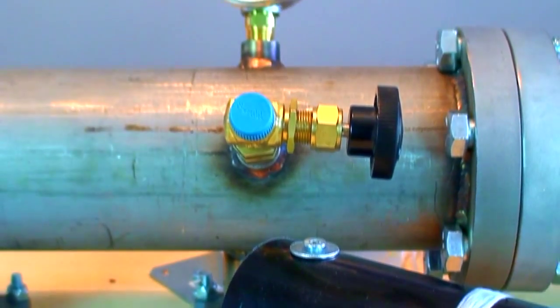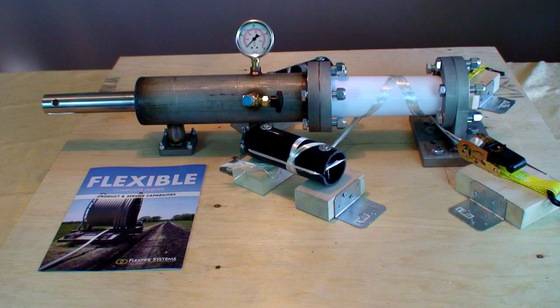We needed to wrap the fibers around the bladder at a specific angle for testing purposes. The tension towers do that. They are placed in certain positions to guarantee a 55-degree wrap angle around the bladder. This has been capstone design project 24, the Pipe Flexor. You're welcome.